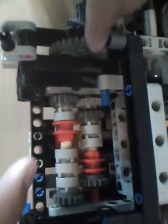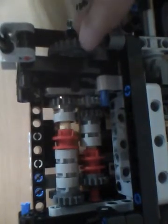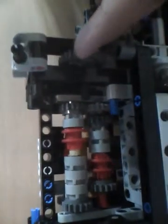As you can see here, the power is not being directed to the pump. I can't show you the levers I'm moving, but if I switch the yellow lever to neutral, you can see it moves into the neutral position and does not move. If I switch it down to the pump setting, it will move the pneumatic pump, which is over here — and as you can see, it is moving. Now let's switch it back to the setting for the second transmission area. What's happening now is if it's set in neutral, it's still moving, as you can see, and it's actually moving the front and rear PTO.